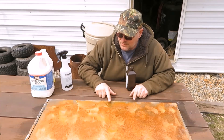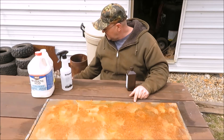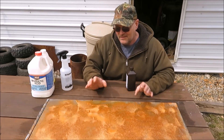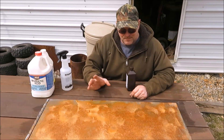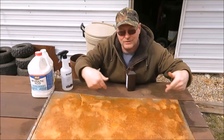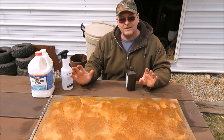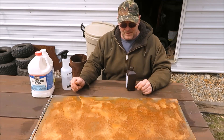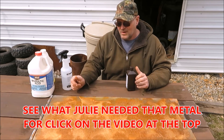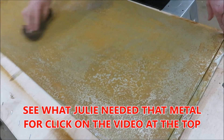As you can see, the rust is wiping right off if you don't leave it long enough. You want to leave it on there a couple of days so you get a good heavy coat of rust — two to three days and you could really have a heavy coat. So that's my way of rusting galvanized metal. You can see there's the old galvanized and this is what we've got it to look like now. A couple of days — take your time and you'll have it done. Thanks for watching, don't forget to subscribe, leave a thumbs up, thumbs down, or a comment. This is definitely some good rust, and this is after three days.